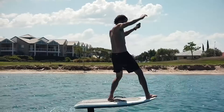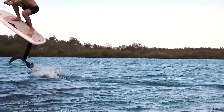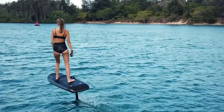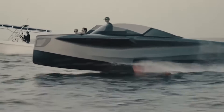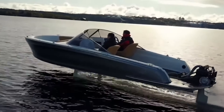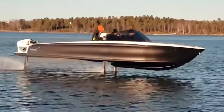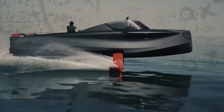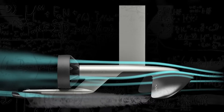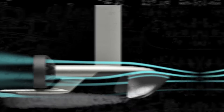You may be asking yourself: what is a hydrofoil? In terms of its design and how it operates, it's actually pretty simple. A hydrofoil is literally a wing that attaches underneath some sort of boat, raft, or vessel. It works in the same way that the wing of an airplane works. As the vessel moves through the water, the shape and design of the wing increases water pressure on the underside of the foil and decreases it on the upper side.